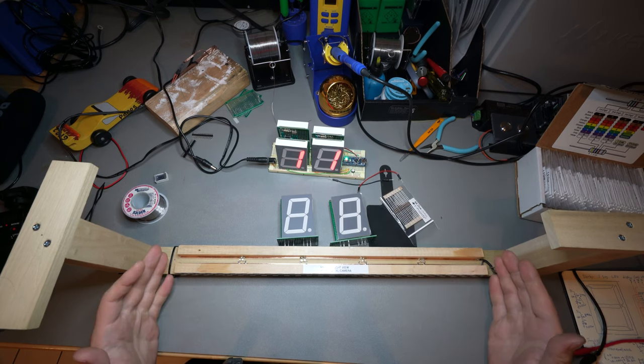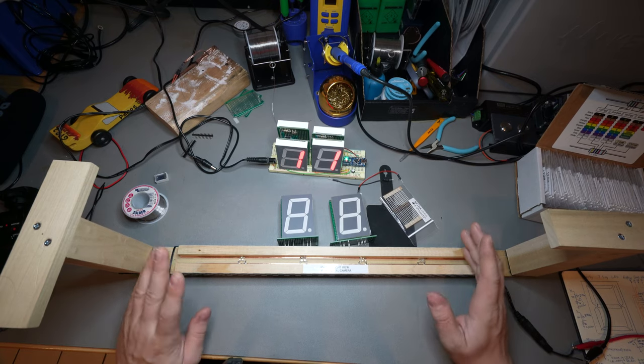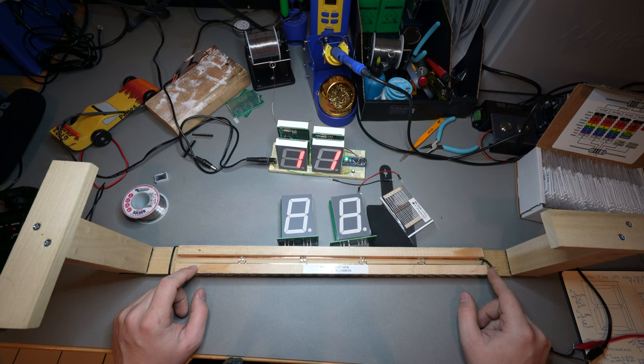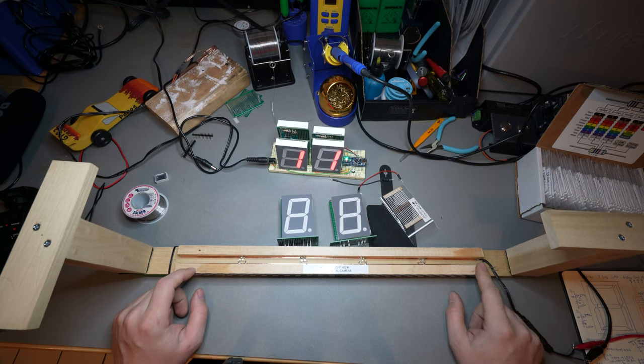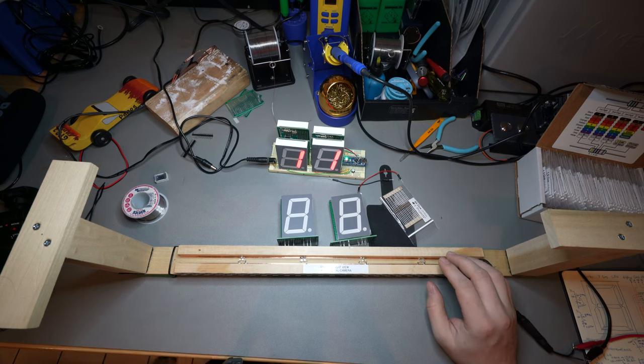So I wanna just convert this whole system into 12 volts. Plug in 12 volts, everything works. And that's where I run into issues. I thought maybe I could just convert these by putting in a resistor or something to 12 volts, but trying to limit half an amp at 12 volts, the wattage takes quite a bit.